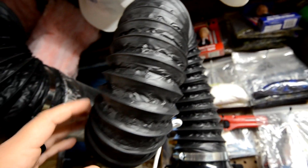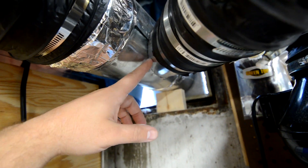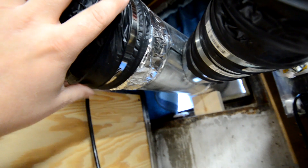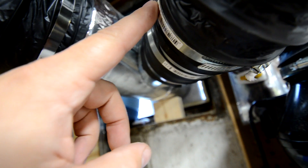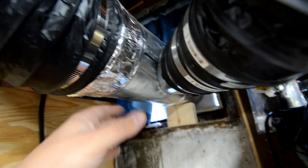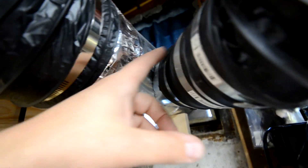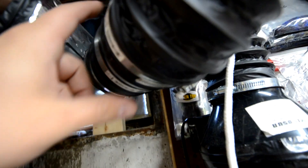I got this flexible four-inch tube, and it goes out to a little reducer or combiner, because I have another fan system here that goes to my plastic sealed box. So each one of these does something different — this four-inch is for the lead, and the other one is for my plastic station and airbrushing. I have aluminum tape to seal the joints where they make up, and four-inch pipe clamps to make it nice and tight.